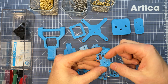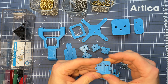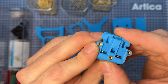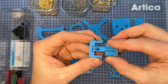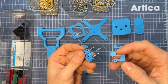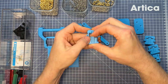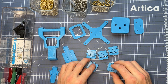As you're pushing the mechanism in, you want to lift that little cantilever arm so that it snaps into place. Move it up and down a couple of times to make sure there is no wiggle, but also that it's not sticking. If your mechanism is sticking, check your print settings as they could be off, and make sure you're using the same material. Another problem could be if you put the heat set insert at an angle or melted the material too much — that could cause the wall to interfere with the mechanism and prevent it from moving up and down easily.